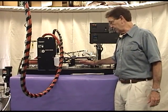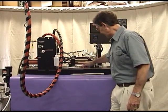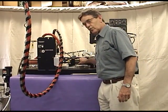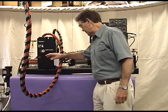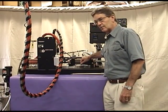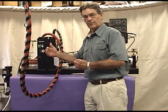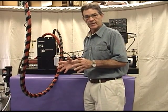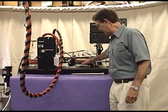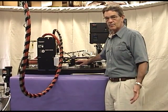An important feature of this system is that it has one continuous shaft onto which the pistons for the metering cylinders are attached. So if the catalyst piston moves, the resin piston moves and you don't get phasing as seen in side-by-side systems. Whatever happens on the shaft happens on both sides — it's an inline piston design.